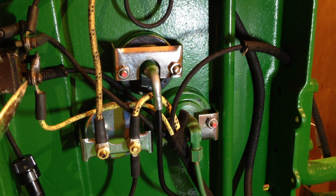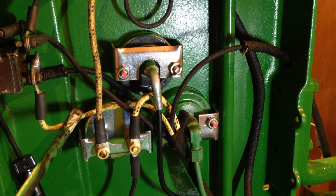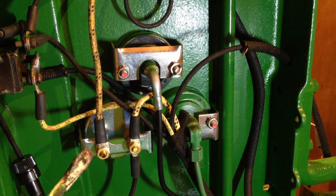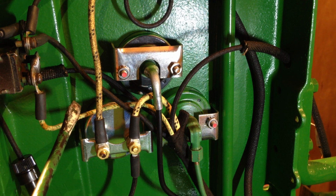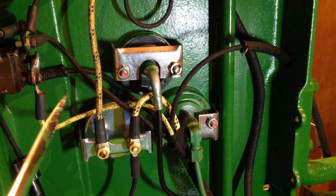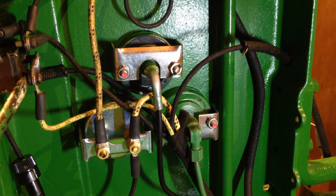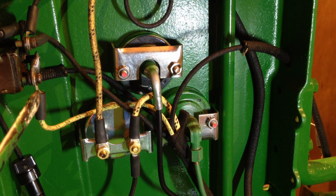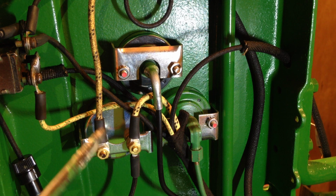So the resistor works in that when the switch is in the total off position, the current goes through the resistor wire to the fields in the field coils in the generator, and through the magics of electricity, the low voltage it produces in the field coils regulates how much power the output is back down this cable here. When you move the switch into the other 2 positions, the first one being just a general charging position, the resistor is bypassed and the whole system is grounded, and the power gets full power down this cable to the field coils, which ups the output of the generator.